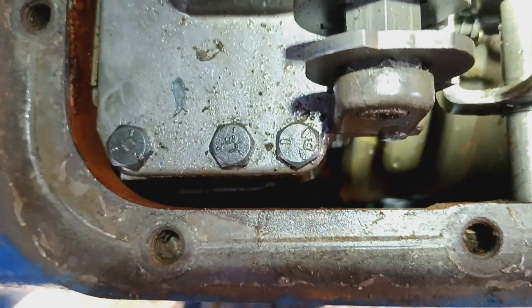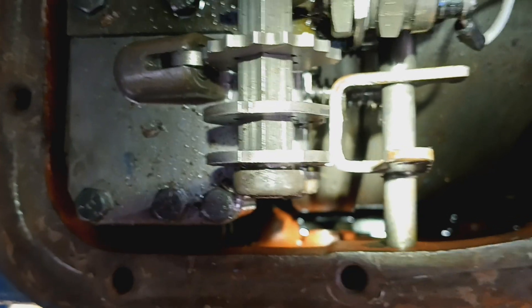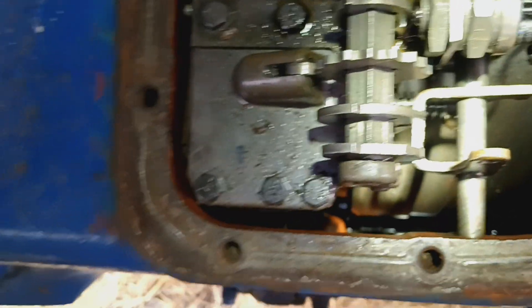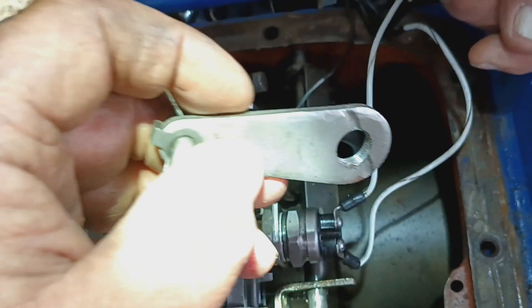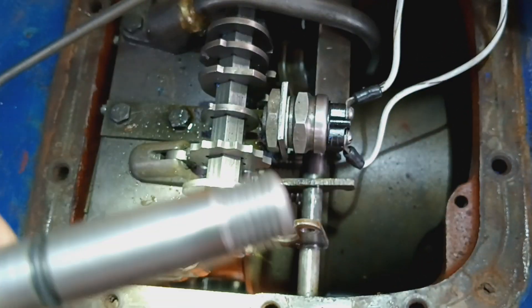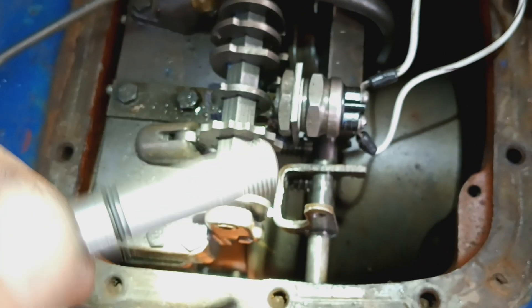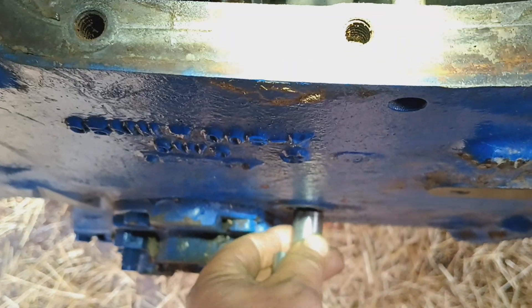You cannot put a stock brand new replacement lever back in without splitting your tractor in half. So what we did was: we took the broken lever, punched it out, got a piece of stock, and got a tap and die that was reverse thread — so when you push on the pedal, it tightens. Now we're going to put the bushing back in the hole.